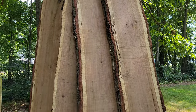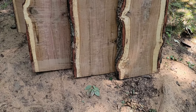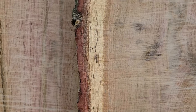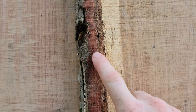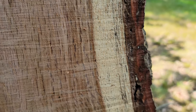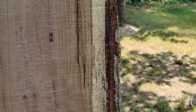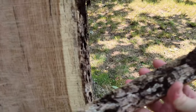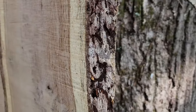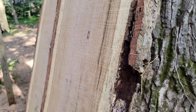Not a bad harvest for something the ants ate most of — I'm getting about 14 to 16 inch wide white oak slabs with some nice spalted sapwood. I do have to make sure I cut off the bark because there are borers — some kind of boring larvae — in there, and those things will just continue to eat away. This wood is already a bit soft there, but it's salvageable. Once it dries, the borers will continue eating as long as there's moisture, so by cutting off the bark I'm helping get rid of that food source.